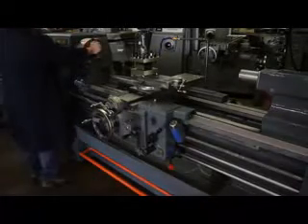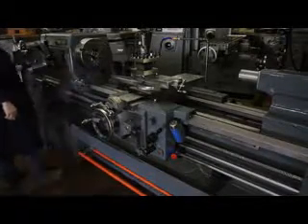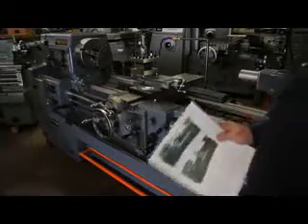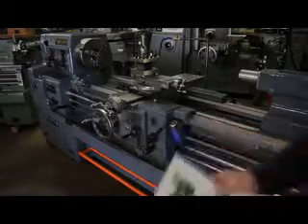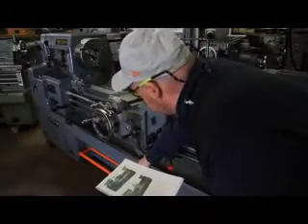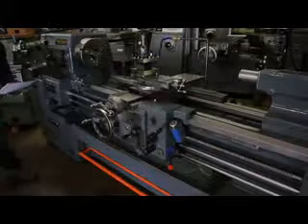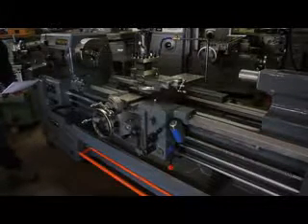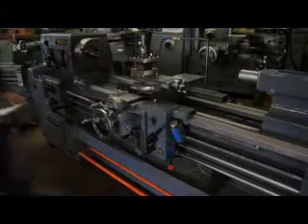We always like to emphasize safety first here at Machinery Consultants in Salt Lake City, Utah. One of the nice features about this machine is the fact that it's so convenient, easy to run, and operator friendly, as well as safe to operate. The machine is equipped with an overload safety device for feeding and thread cutting, going off of this lever here, as well as kick-out dogs provided on the adjustable carriage feed stop dog on the bed that engages on the longitudinal feed. It has the OEM four-way tool post.